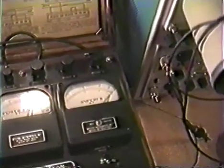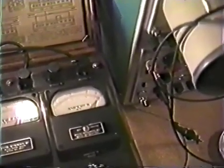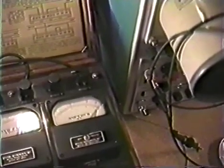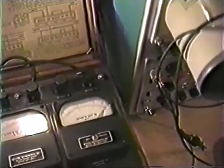Okay, coming on over. The power factor shows 1 as it will in the resistive load. And of course single phase circuit. You can see now the amperes on this meter being put out by the machine is very clearly, let's give a read on that. We're putting out 4.6 amperes of current. 4.7, a little more precisely, 4.7 amperes of current. And so that is the output current.